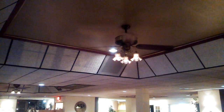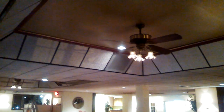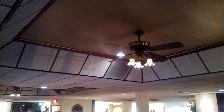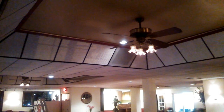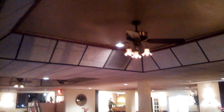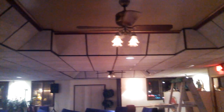If there's nothing wrong with the fan, there's nothing wrong with the fan. Yep, it's definitely spinning down first. This is really odd because when I tested them on the bench, the motors had exactly the same spin-down time — that was without blades, though. So either it's the blades, or something's rubbing on something that I didn't notice. You'd think you would hear that, though. Just goes to show you — you just never know. You can't predict something like that.